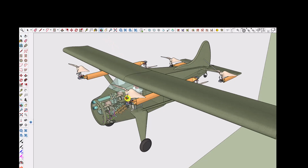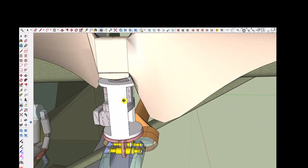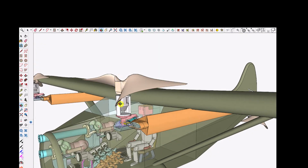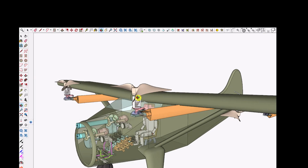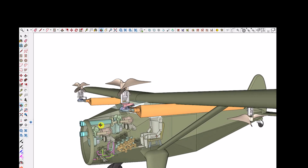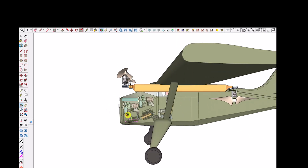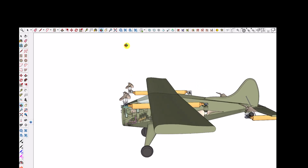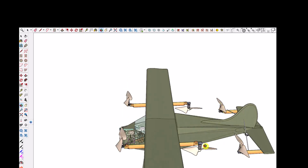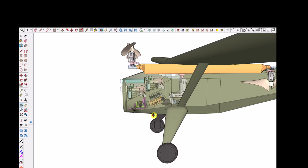And I've already done a discussion on the concept of using a bent axis hydraulic motor to spin the propellers. I've got extensive YouTube videos on that. And so this takes hydraulic flow that goes to this motor and it spins this propeller around. And the way that this hydraulic flow is created is through a turboshaft jet engine. And I'm showing that inside the de Havilland, the amount of power needed for the plane to just fly along is about 90 horsepower. But to get it to go straight up in the air with these propellers takes about 850 horsepower. So one engine will fly the plane, but you need two engines to make it go straight up.